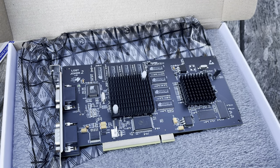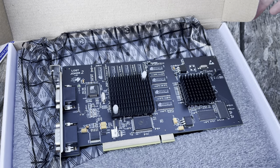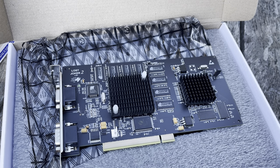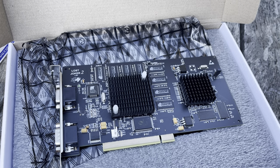Now I think it really needs some active cooling for the Voodoo 3. Anthony said if it's running at 85 MHz he highly recommends proper active cooling, but if you downclock it to 66 MHz it should be better. Anyway, this is just a very quick unboxing of this amazing video card that Anthony has put together. Later I will do a build with this in it. Happy GPU June, see you guys soon.